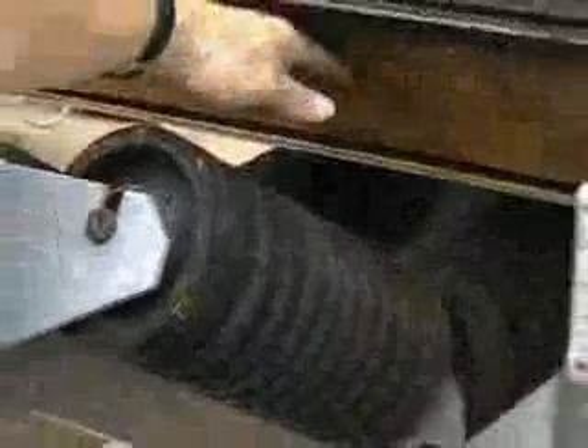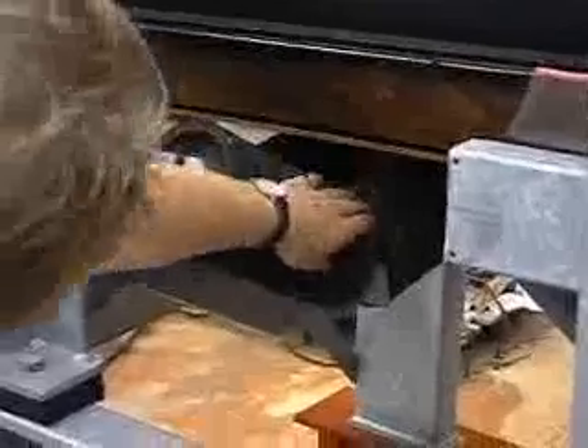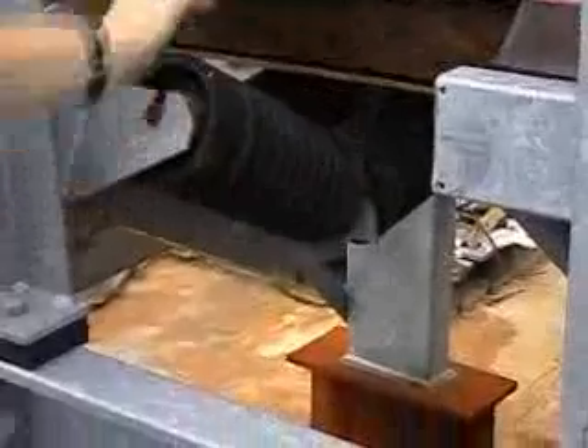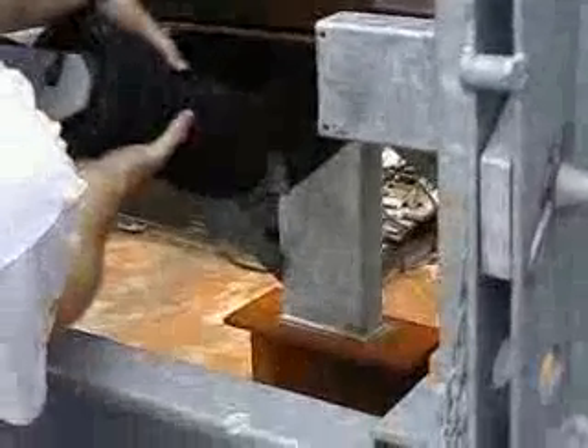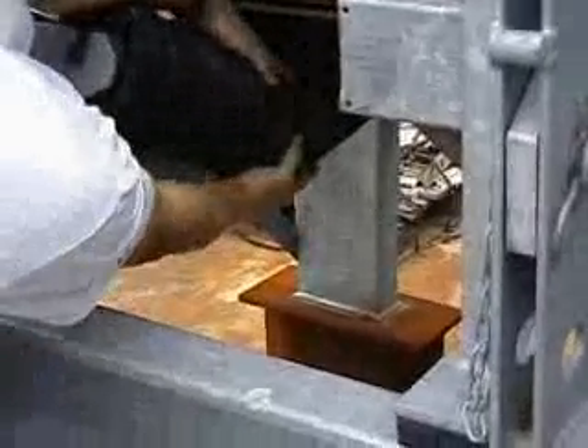This is a 1,050 wide belt; it can be moved up and down with ease. All you need to do is change out the rollers. You can see the gap — this is about a 100mm gap, and the gap between the central roller is about 70mm at the far side. All you need to do is lift the roller out to slide it out, which can be done quite simply. I can lift that out nice and easily. I can do the same with the central roller — I can lift that out also.